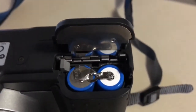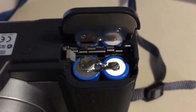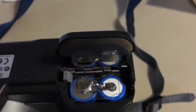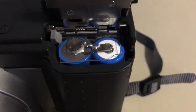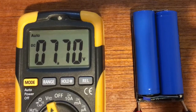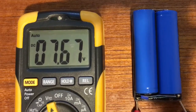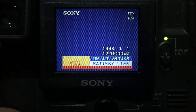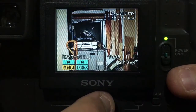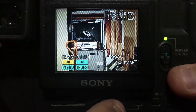It doesn't really matter though because it all fits in there without it. I've used a piece of plastic to insulate where the two terminals connect from the shield outside the battery cover on the hinge, because they're not common points. My meter reads 7.7 volts DC across the battery terminals — open circuit — and the camera does work with this new battery pack, though it's always reporting a very low battery level.